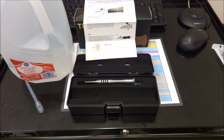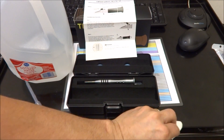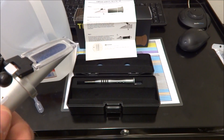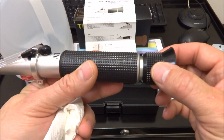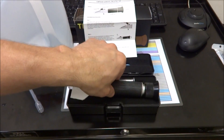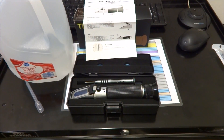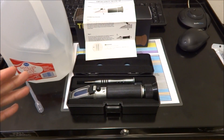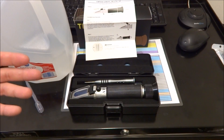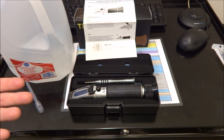Then you just clean the lens off, take your coolant, drop it on there, and check your refractive index. This measurement is in BRIX on a BRIX scale — B-R-I-X. You can focus with the eyepiece here. It's a very well made unit and I think this is going to help alleviate some of the issues I've had in the past with the imbalance of the pH.